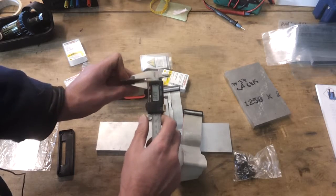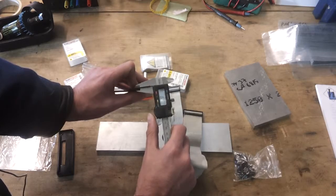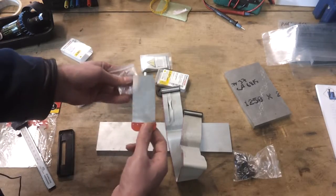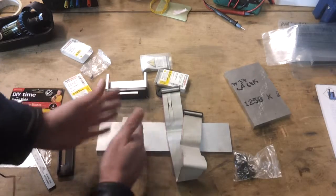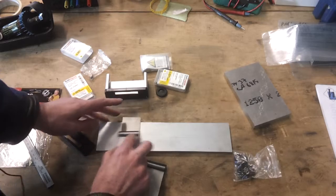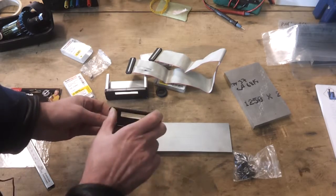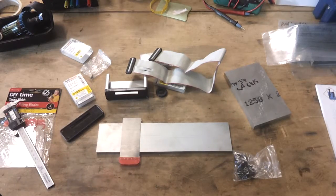Thickness-wise, as long as it's not over a millimetre — that's well under, about a quarter of a millimetre. So if I just cut a pocket 250 microns deep, get a couple of magnets in there — and it is indeed magnetic — that will click in. As long as it's a good tight fit I shouldn't get any flash. And then my grommet will go across this way, double-sided mould. It's just a case of making sure it fits and finding a material that will squash through, but we'll get this set up to begin with and worry about the material when we get onto the moulding.